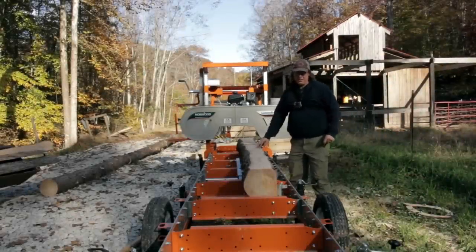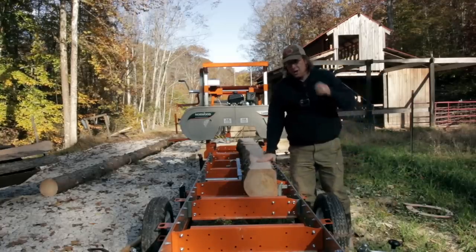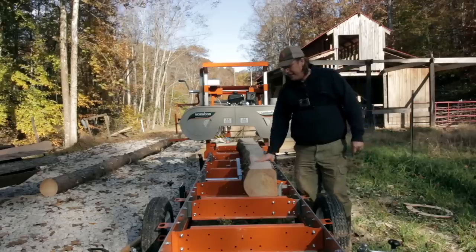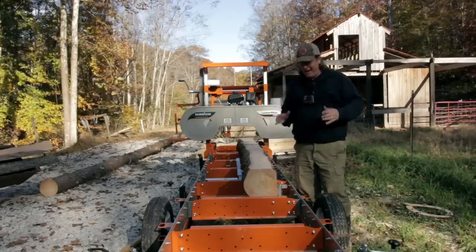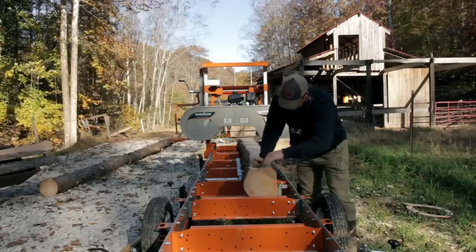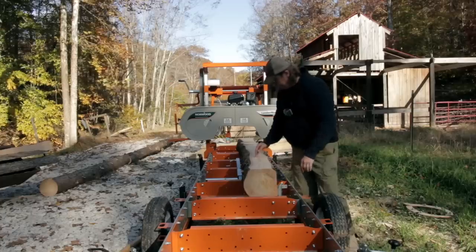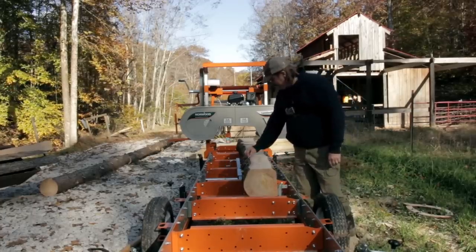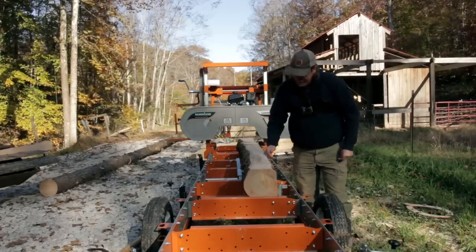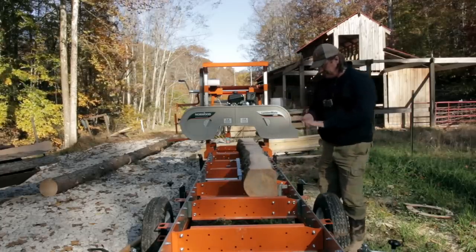On my third pass, this is where dimensional lumber obviously becomes a little bit more work. I made sure my pass was no less than eight inches in height from the deck — that's what I want. I want two by eights. So I decided to make my two by eights inch and a half by eight, so this distance here is eight inches. When I do my third pass and flip to do my fourth pass, that's when I'm going to start cutting my two by eights out. It left a little bit of natural edge here, so when I flip this over 90 degrees and start cutting off, my last board and maybe my second board are going to have some bark on them. But I'll have a nice square edge, and we'll see how many boards we get — estimating maybe five, maybe less.